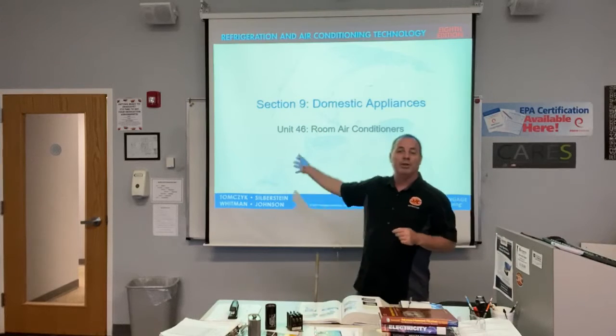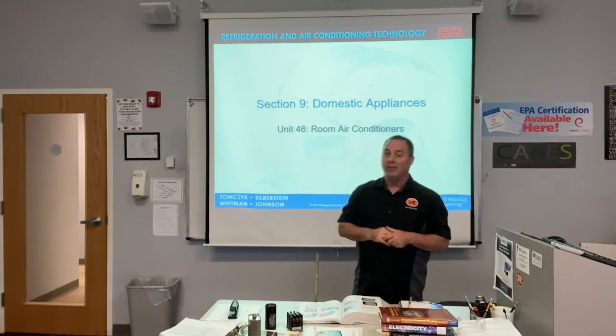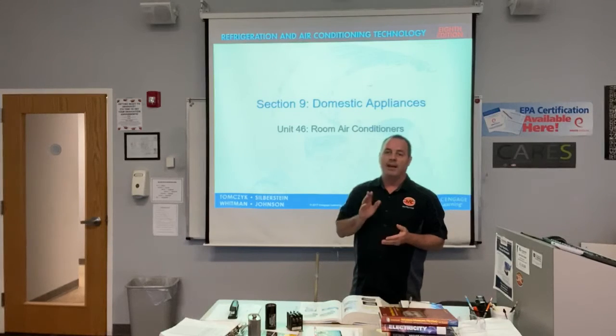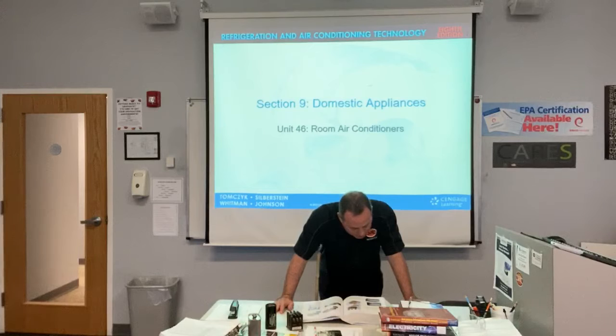You can get them a little smaller or larger depending on the manufacturer. One of your essays this week is to research the largest window unit you can find in capacity — most of you will find a 36,000 BTU, 3-ton unit. You have to provide details: manufacturer, model number, whether it has electronic controls, and all kinds of specifics. Some units are front discharge and some are top discharge; top discharge is most common and the controls are at the top.